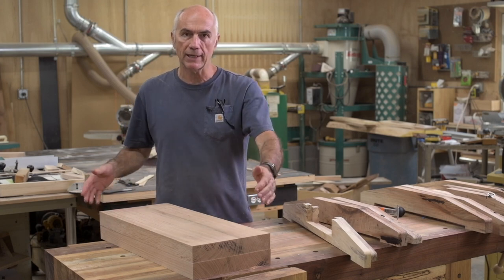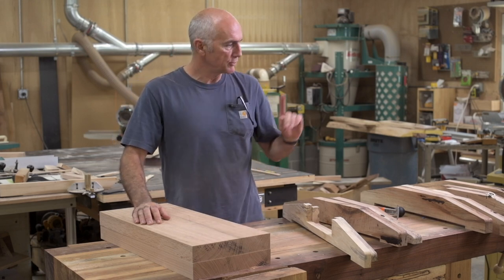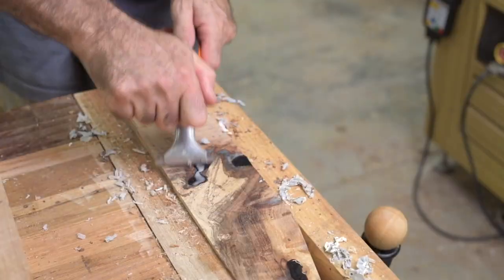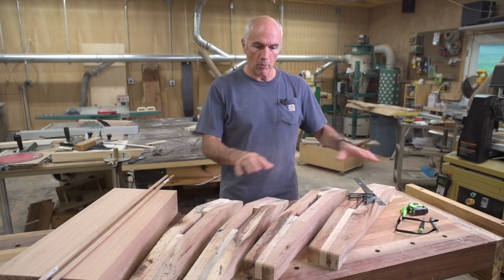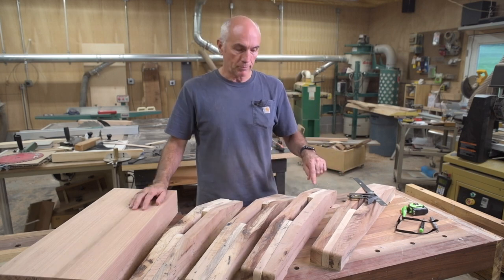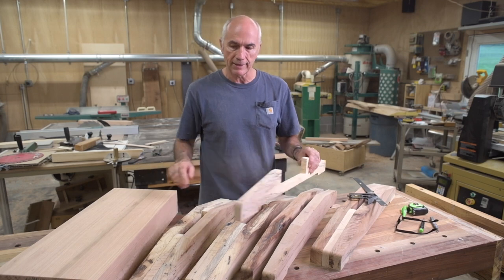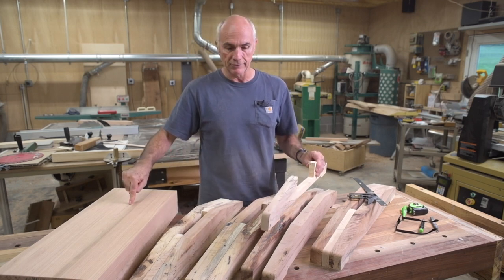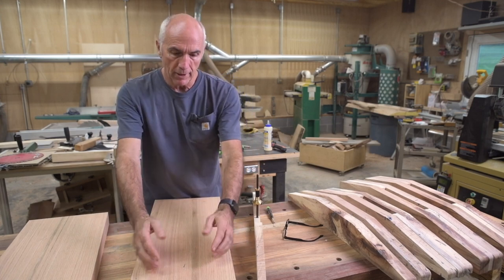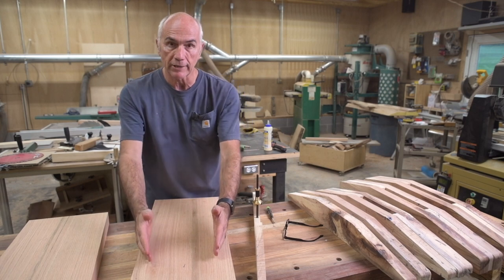My upright pieces are cut to their final width and height. I am going to taper them and I still need to figure out how I'm going to do a proper tenon on them. So I want to get my base and top pieces glued together. I've got everything grouped how I want it, so I've numbered them and put registration marks on there so I can always get them back to the same orientation. I wanted to glue these up tonight but I'm having second thoughts, because I think it might be nice to have access to these middle pieces which will receive the tenon when I'm laying out the tenons on the upright pieces. I think it's going to be easier to manage them and cut the tenons with them still rectangles — cutting that slight taper is going to be the last thing I do.